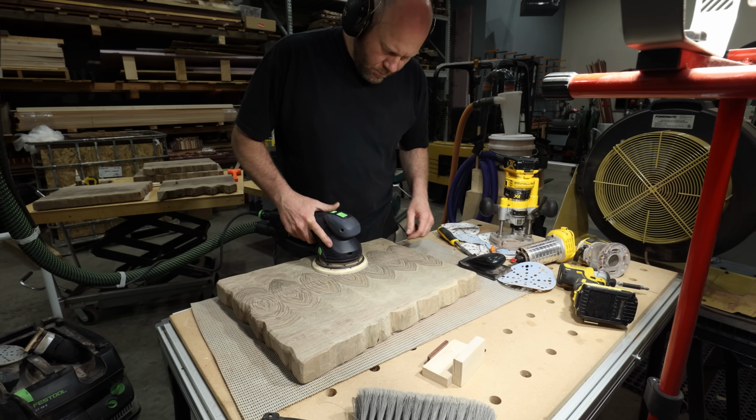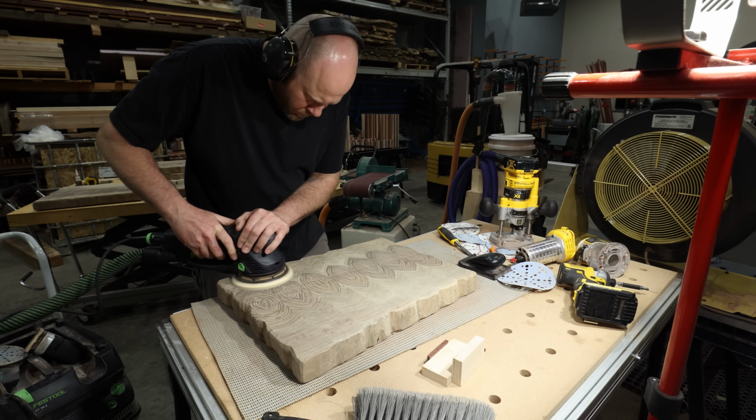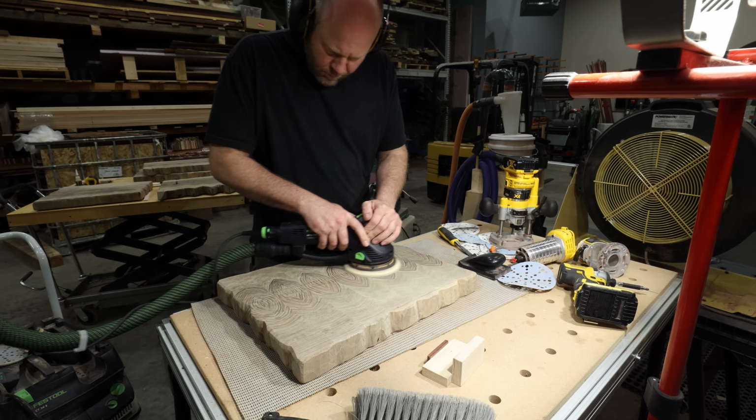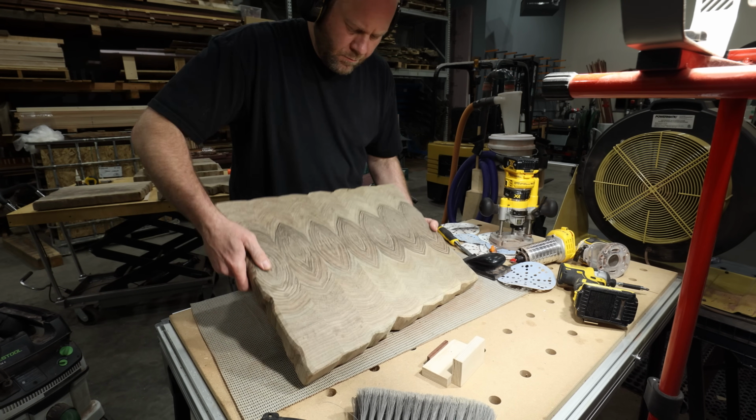I could only sand the blocks through the wide belt sander to 80 grit because I was having an issue with the live edge burning up the graphite pad on the platen head on the wide belt sander. So I had to sand these from 60, 120, 180 grit before juice grooves.